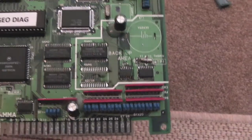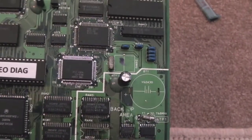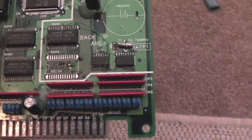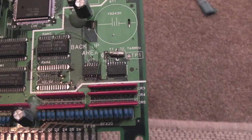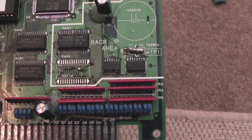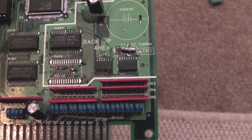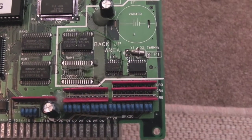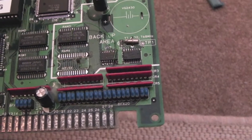This board with the replaced C1 — I've put the faulty C1 back on and just done some tests, and it's still saying backup RAM. It's a slightly different backup RAM message since I removed that wire. I think it's saying the upper chip has a problem, which I think is RAM 4. I'm going to try swapping RAM 4 over with a known working chip and see what happens.